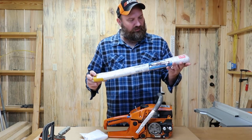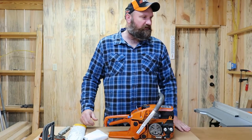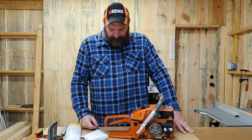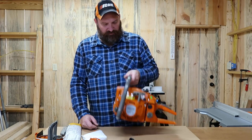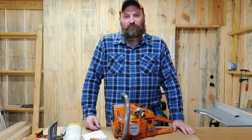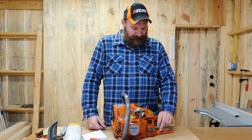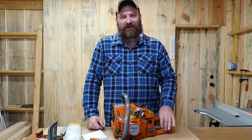Anyway, the bar I ordered came separate. You just buy the power head, and the power head itself is about $122. The bar and chain was around $10 — not much — and I wouldn't expect too much out of the chain or bar itself. I thought I'd give it a try. It is a 58cc saw; the power head weighs about 12.3 to 12.4 pounds and puts out 3.4 horsepower. I was going to use it to do some woodwork with a sawmill attachment — a small attachment I'll show y'all in a future video. I got a lot of other saws I could use, but I guess I just wanted an excuse to buy a new chainsaw — and I did want to try one of these saws out since I'd heard some good things about them.